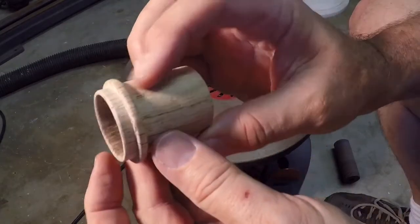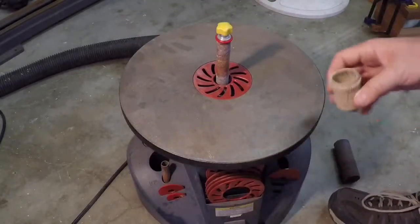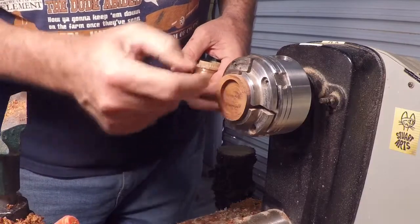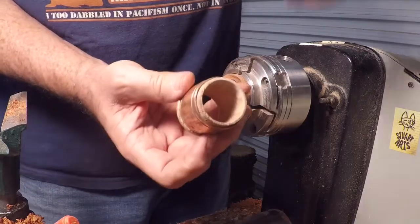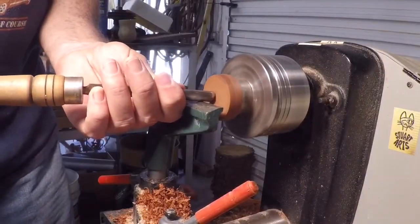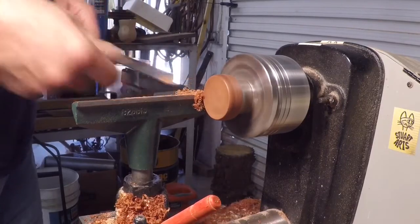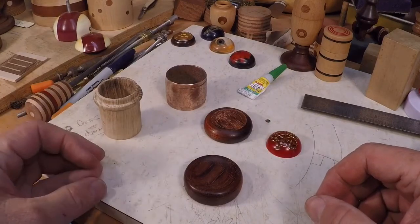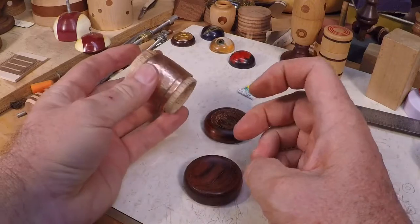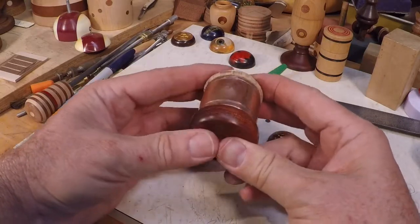This barrel that the copper will go over is a little bit charred — when I cut it with the Forstner bits the heat generated a little charring, so I'm going to clean this up on my spindle sander. I've got my little piece of Cocobolo mounted in the chuck and I just turned out a recess to take the bottom of this little barrel — I went back and forth and I've got a nice tight fit. I flipped the bottom around and I'm cleaning up the face, making it a little bit thinner. All the pieces are built and I'm just going to do a fit-up here. The copper ring goes on the barrel with a nice sliding fit. The bottom goes wood to wood at the bottom — there are no gaps or anything, so that turned out good.